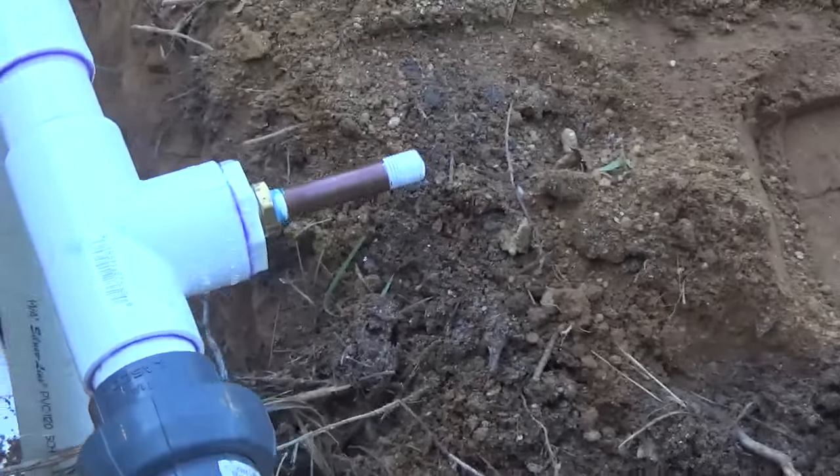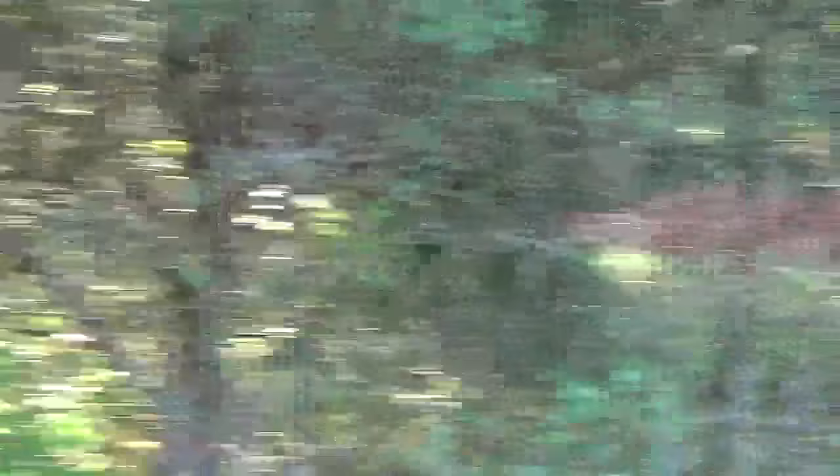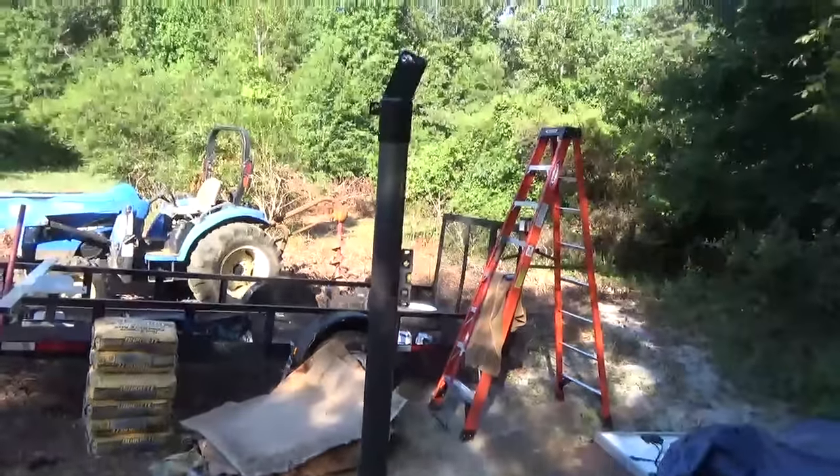I've just teed in and I'm burying this bladder tank. I've pecked over to my line — my inch-and-a-quarter line — that's going to go up to the tank about a thousand feet away. You can hear my buddy digging like mad with the track hoe. I'm going to put conduits in and run wires up the pole for the power and the controls.